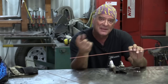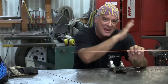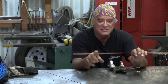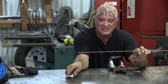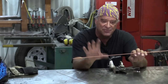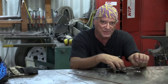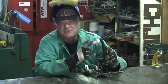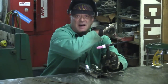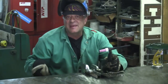Let me put my helmet on. Let me fire up the AHP Alpha TIG over here, and I'm going to set up the amperage to weld this 16 gauge. Sixteenth of an inch tungsten, 55 amps on the AHP Alpha TIG. Let's start out with the eighth inch.